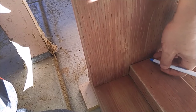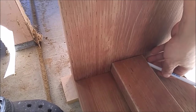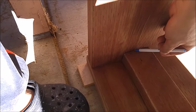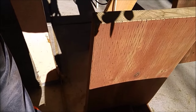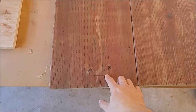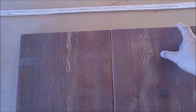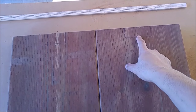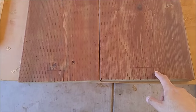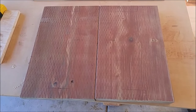My next objective is to make a hole or passageway where this support beam goes onto my bench. I'm going to work on both ends. Now that I have my notches all planned out and basically already marked into the wood, all I have to do is trim along inside those lines. You could use a band saw, a jigsaw, a table saw, or even a hand saw if you're really careful about it.